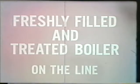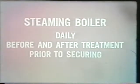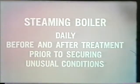The frequency of boiler water sampling is determined by the status of the boiler. For a boiler that has been freshly filled and treated, sampling is performed when the boiler is placed on the line and continued until test results are within limits. In the case of a steaming boiler, sampling must be performed daily, before and after any water treatment, prior to securing, and whenever unusual conditions arise.